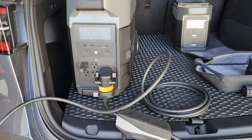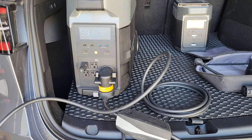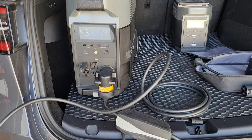For reference, it says it'll take about 16 hours for a 50% charge on the car. We can even turn it up briefly to 30 amps, which takes it right up to the max of 3,600 watts.